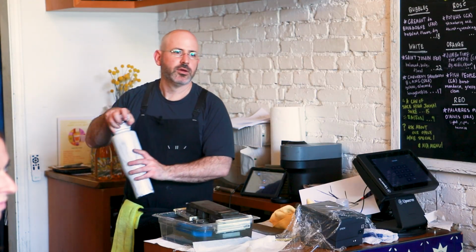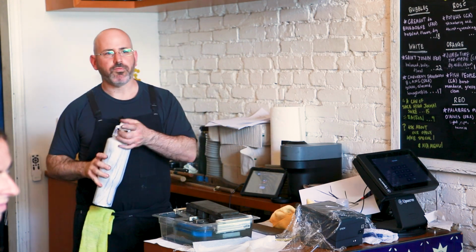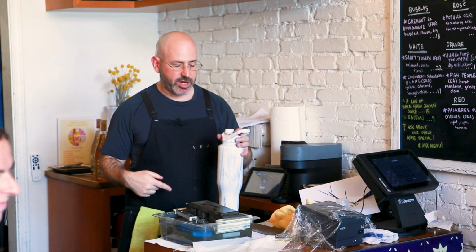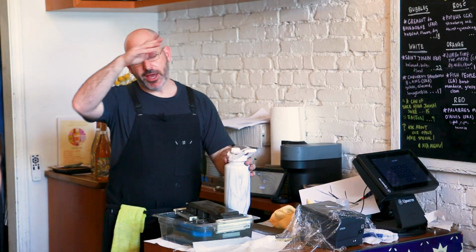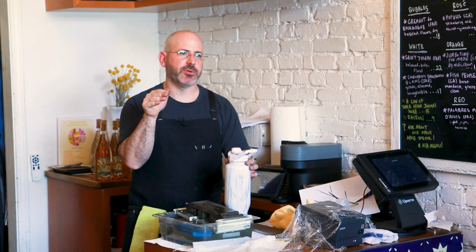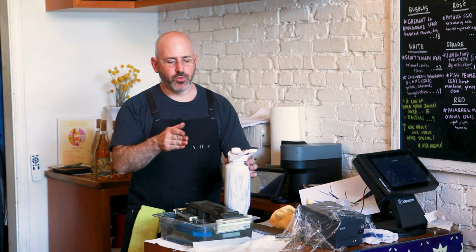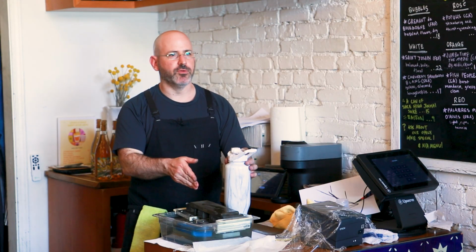I had a chip. I got rid of it, and now my edge is like, woo. What am I to do? Exactly what I just said. If your edge is all wavy and wonky, that means that when you were trying to repair the chip, you spent a lot more time sharpening in one area than the rest of it, and that's the burr too big in one area problem. And the way that you would solve that is this reprofiling move that I just talked about.